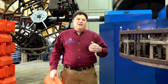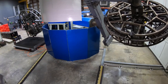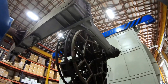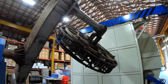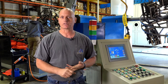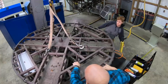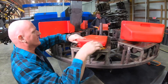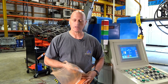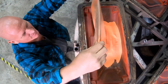We heat the mold, we rotate the mold out of the oven. After it comes out of the oven, after it runs through the cook cycle, it will come over into the fourth station, which is the cooling station. They can cool under many different controlled conditions. It may be ambient cooling where we just use the air temperature. We may use fans, or fans with mist on it. It all depends on what the product is and what kind of warpage we may have to control. Lastly, the arms rotate back to the station where the molds are opened. The parts are removed and new materials placed into the mold. We take a pelletized material and turn it into a dust, and this dust is what we load into the mold itself.